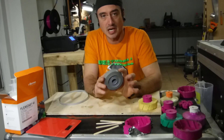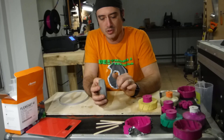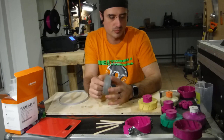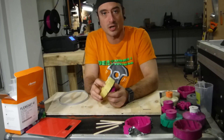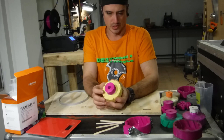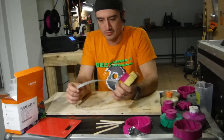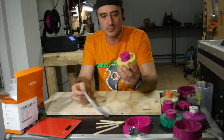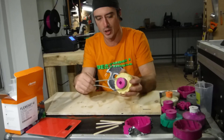I have to order them from America which adds to the cost and they take forever to get here. You can put a hub in it and then a grub screw to lock it onto the shaft, which is good. But I wanted to try something different and go full wheel drive with my robot, so I needed some timing pulleys — normal timing belt, 5mm pitch, 27 tooth pulley — and it fits perfectly.